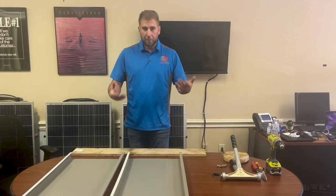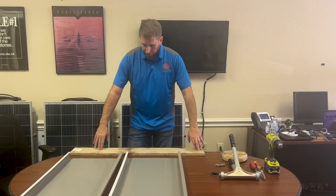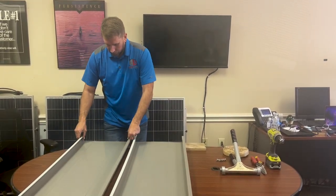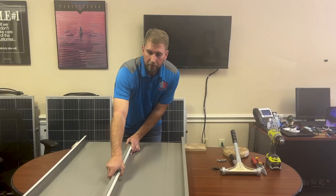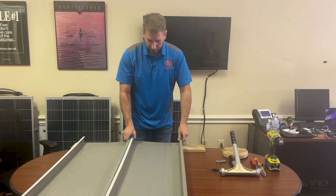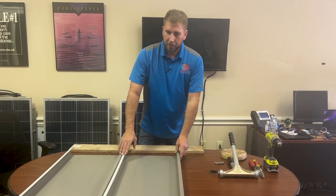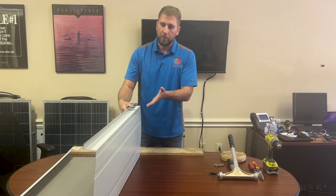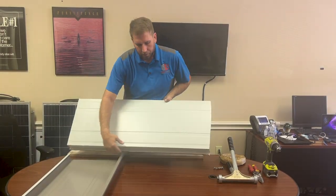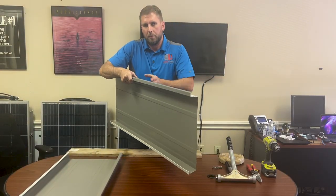All right, so for the purposes of presentation, this is our leading edge of our roof, and the panels will sit on it like this. You'll have to imagine that the roof has a pitch. So let's all use our imaginations on this. This particular panel is rated for a 1:12 pitch or higher, and the reason we can do that is because within this seam there is a heat applied butyl as it comes out of the roll former, so it seals the ribs, so we don't have to apply butyl tape in this area.